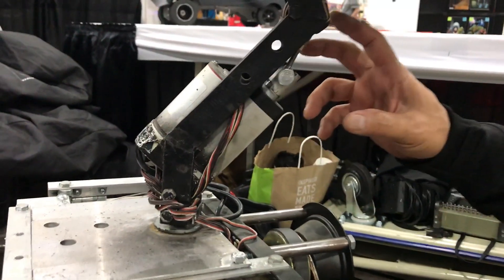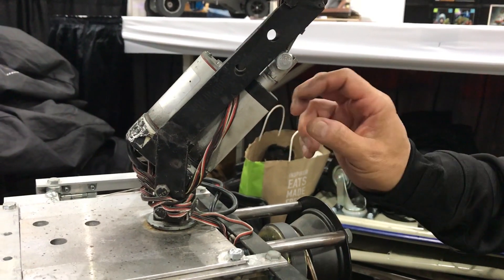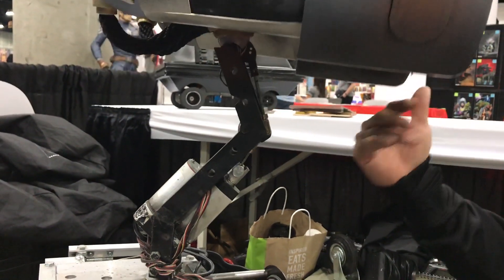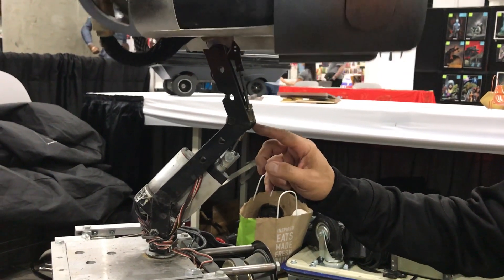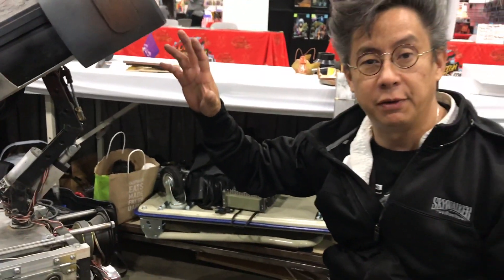So one, I have it here in the neck of my Wall-E. This is rated at 50 pounds and it's a one-inch throw actuator. I get such great movement out of it because I have a pivot point that uses a leverage arm that creates a bigger pivot point here.